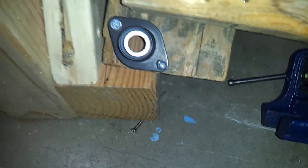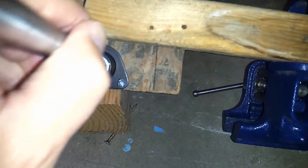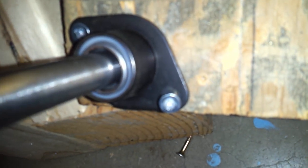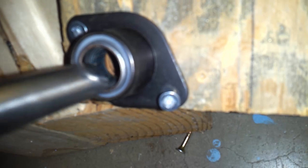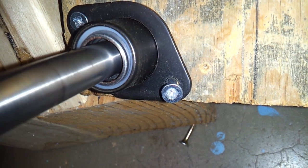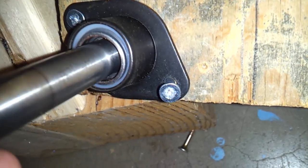I just want to show what kind of bearings I've been using. I've seen references to these called spherical bearings, but what it is is a self-centering bearing. You can put this in here and you can see that it can swivel like this. The reason is that if you have one on one end and one on the other end, they don't have to be 100% perfectly in alignment. You put this through, bolt it down, and you have a bearing — so it has a small amount of rotation there.